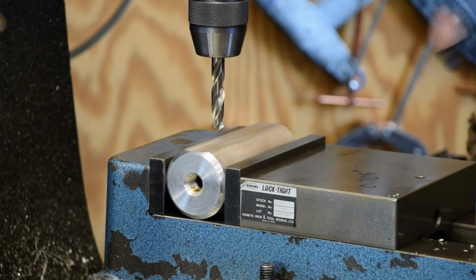Alright, I got it switched around here. I got a 29/64, so no, it's a 27/64 drill in the chuck there, because the only 7/16 stub I got is in the CNC machine and a collet chuck, and I don't want to break that down. So we're going to have to do a 2-step drill process here. It's not that big a deal.